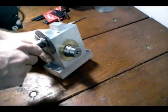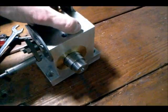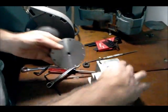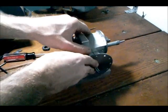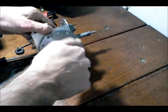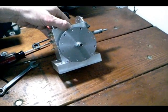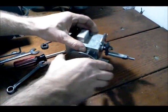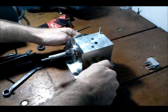Now I can turn it and you can see that when I turn the crank the spindle is turning. To do rapid indexing I have a rapid indexing plate — this particular one is a 24-hole plate. I can put this on the end here and tighten it down with a little nyloc nut. If I wanted to do rapid indexing, I pull out the block that's blocking the worm, roll it away from the worm wheel, and now I can spin this freely.